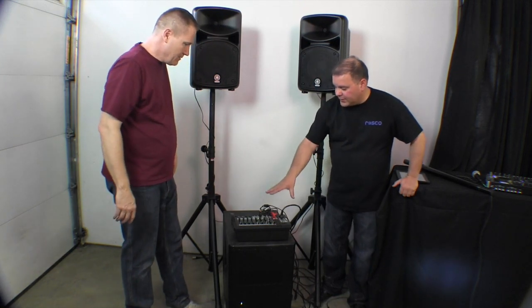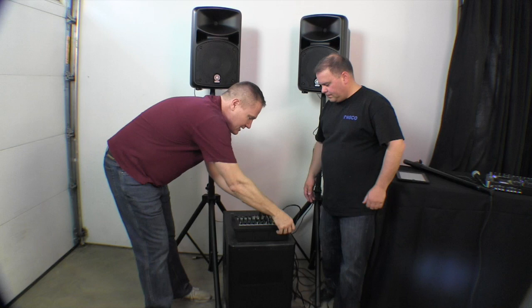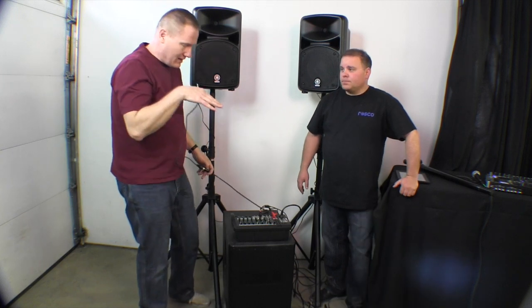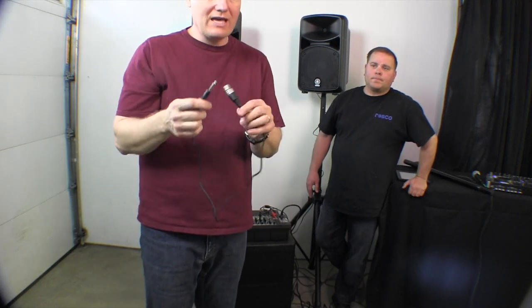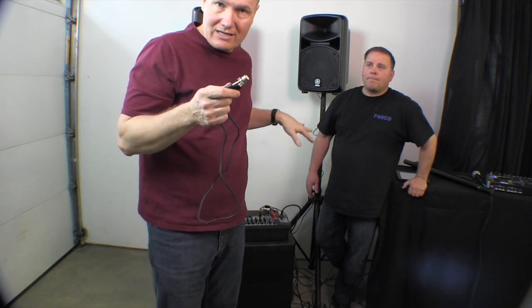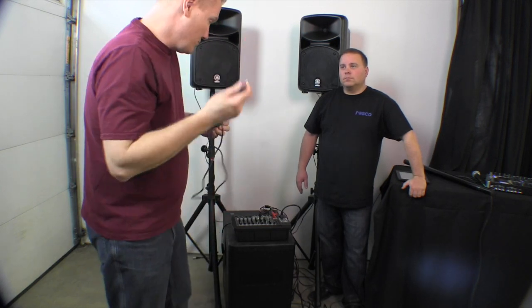So how did we hook up the subwoofer to this? That's actually something I want to show you. It comes out with a quarter-inch jack. We're going out of the board with a quarter-inch, and you go into most powered subs with an XLR — so you need some sort of adapter. I've got a wire that is a quarter-inch tip sleeve, set up to go to the female side. I plugged the quarter-inch jack in from the back with a female side, and it's worked wonderfully.